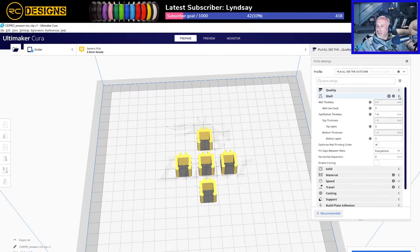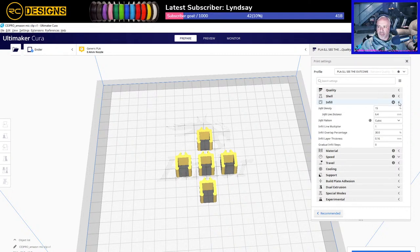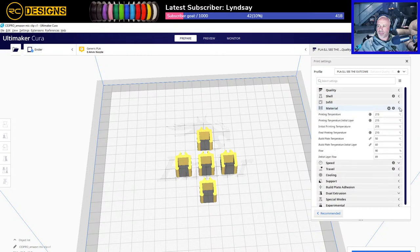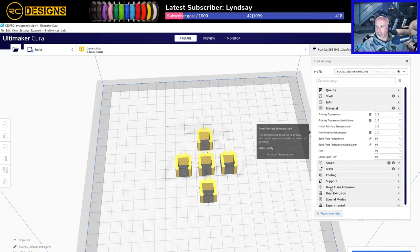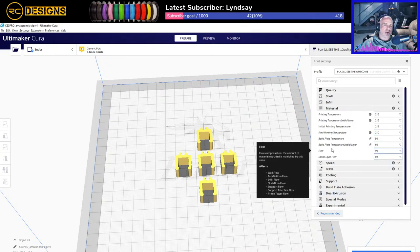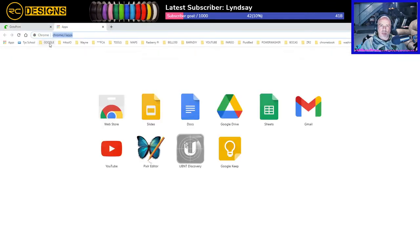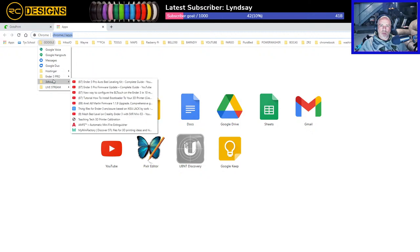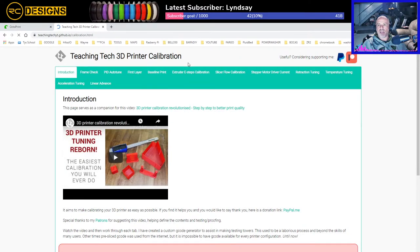My shells, I don't really touch those. My infill, like I said, is at 15%. My materials, I start at 215, I come down to 210. And my flows and my initial flow layer, this has all been calibrated from Teaching Tech's 3D printer calibration. So big shout out to him as well.